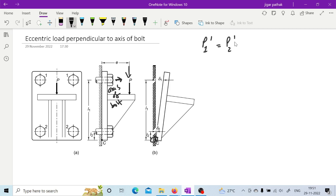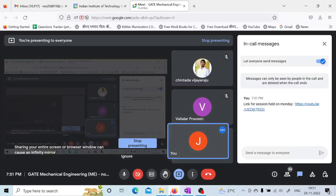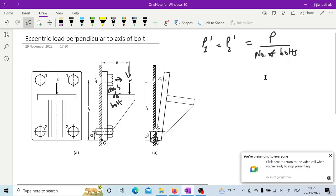But here also, as you can see, the number of bolts is 4, but they have mentioned both lying at a similar location, one as 1 and the other as 2. So this P1 dash is equal to P2 dash, which will be the total load applied divided by the number of bolts. This will give you the primary shear stress, right? Once you are done with the calculation of this primary shear stress, then you need to calculate the secondary shear